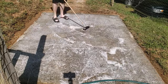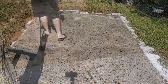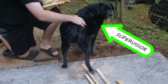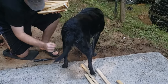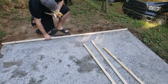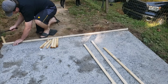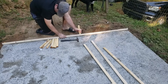Now I'm scrubbing it with a degreaser to finish off the cleaning part. I had to have the supervisor come by and check it out, and after getting his approval, I went and laid out the forms. To make the forms, I'm using some 1x2 lumber — just the cheapest available at the local home improvement store — and putting wooden stakes around the perimeter to hold them in place. I used the old slab as a guide since it's already squared up.